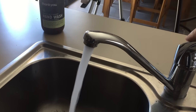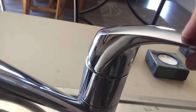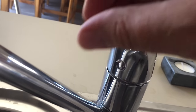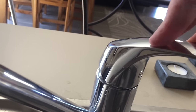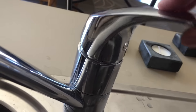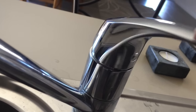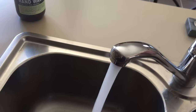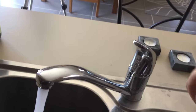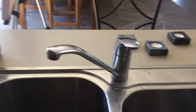You can see the water coming back through. Listen — you hear no noise now; it's beautiful and smooth. It was getting really tight there. A bit of maintenance and lubrication when it's rough and jumping like that prevents wear on all those plastic components — eventually it will start to leak and you'll have to replace the cartridge. But if you get onto it at this stage you can simply lubricate the cartridge and it works perfectly. Give it a bit of a run because some silicone lubricant might come through initially — run it on hot, turn to cold, back to hot, then back around to cold. You're done — excellent repair.